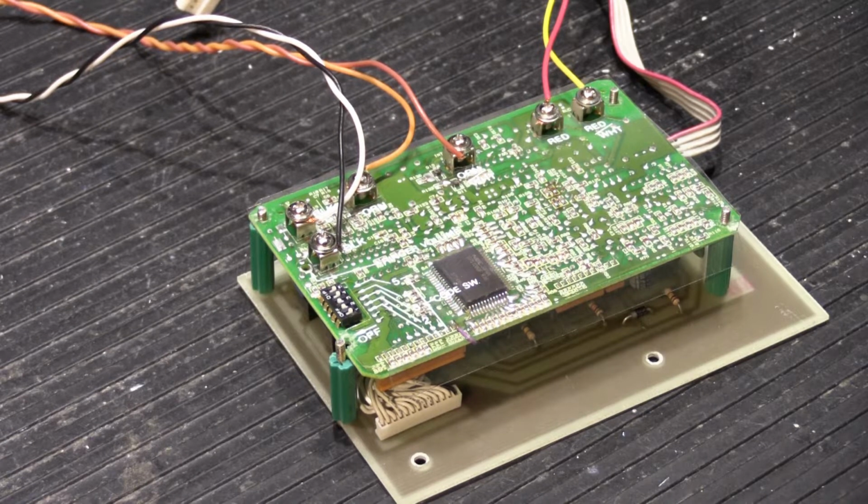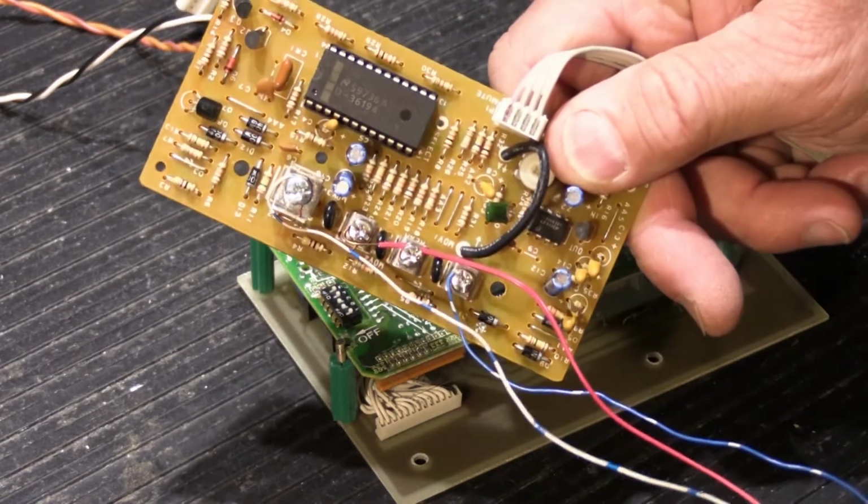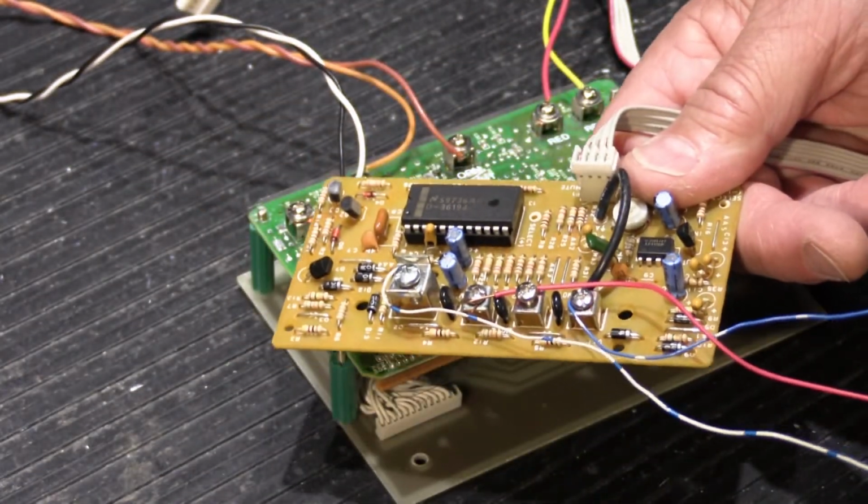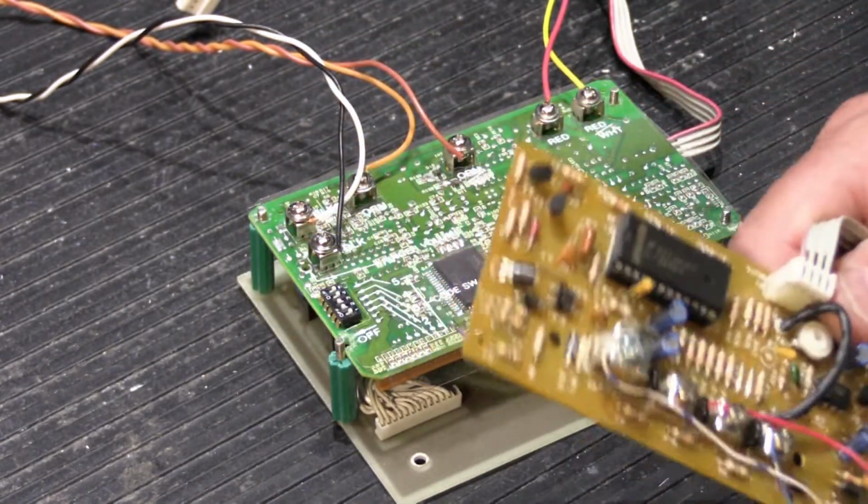Well, one of the complaints about the IM5006 back in the day when it was in production was that if you turned down the radio volume on each of the remote stations, which you can do individually room by room, and on the master station you have a mute button to mute the music, you couldn't hear the chime tones from a Chime module through the system. The Chime module rings through on the radio side of the system, not through the intercom side of the system.